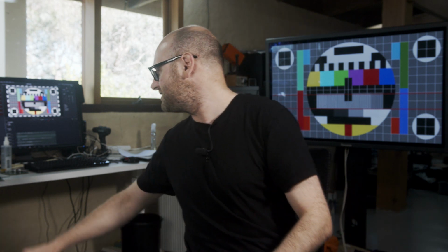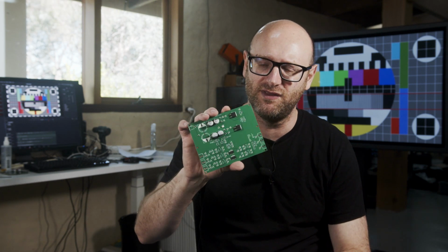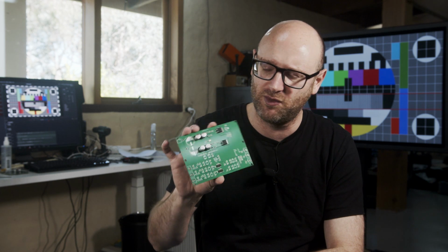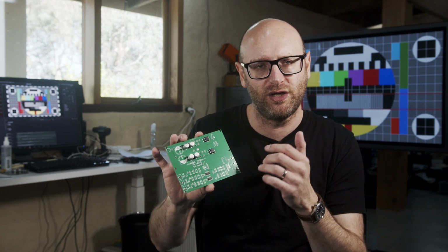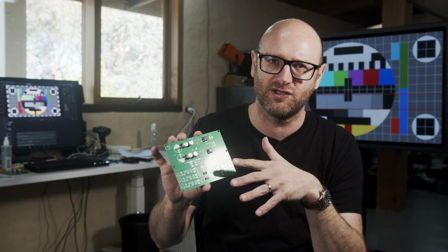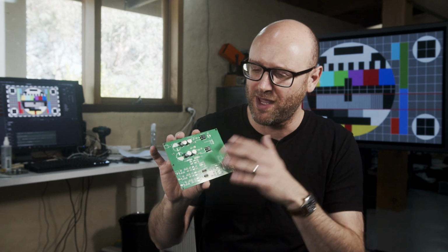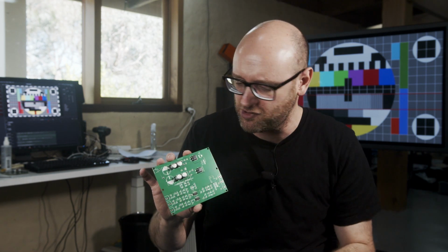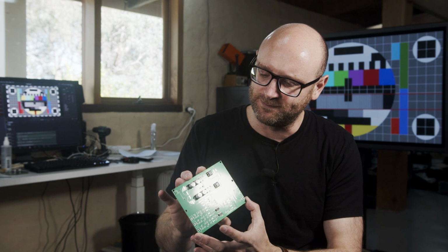The first thing I did was, while we were in the armoured guard quarantine process that you have to go through to get into Australia, I did a new spin up of this board. This one isn't fully populated. This was the board that I shared with you a couple of months ago that takes 3 channels of HD component video in, separates out the sync, and then does a bunch of cool processing with some op amps along here to mess with the colors and to do voltage controlled modulation and things like that.